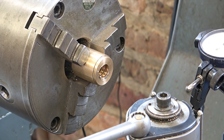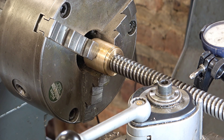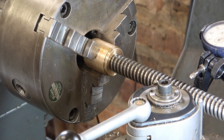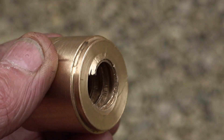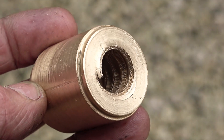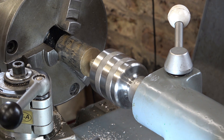We've done it against all the odds. So: mistake number one, putting the cut on the cross slide rather than the compound; mistakes number two and three — twice the tool slipped within the bar and had to be reset; and the fourth, the really big one — I didn't tighten up the banjo fully. From this side everything looks good but from the backside I've examined my conscience and I'm going to make another with the little bit of material I've got. I'll bring you back when I've finished the second nut — if you don't hear from me it's because I've messed up.